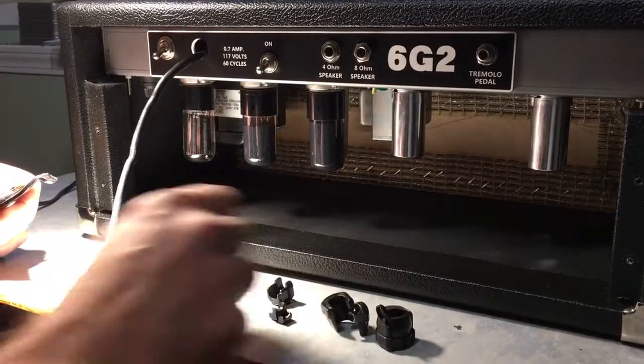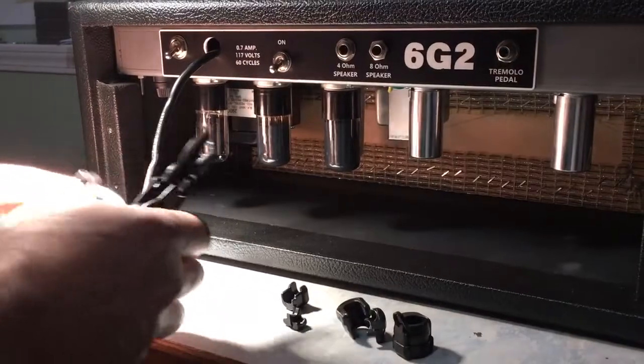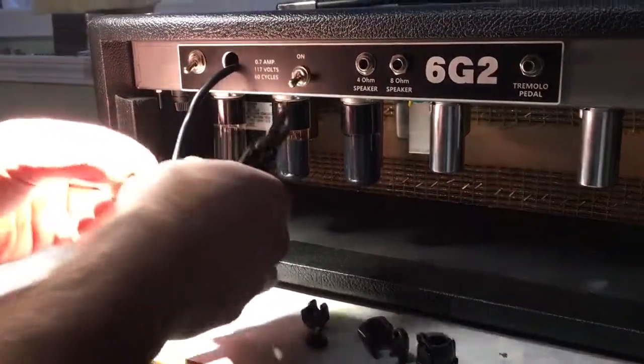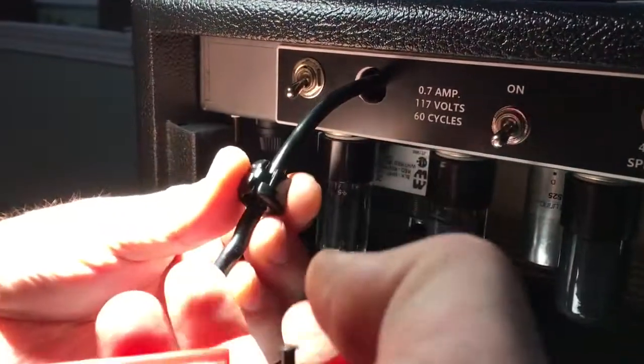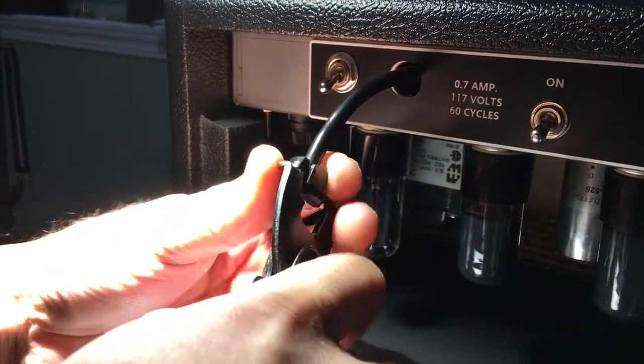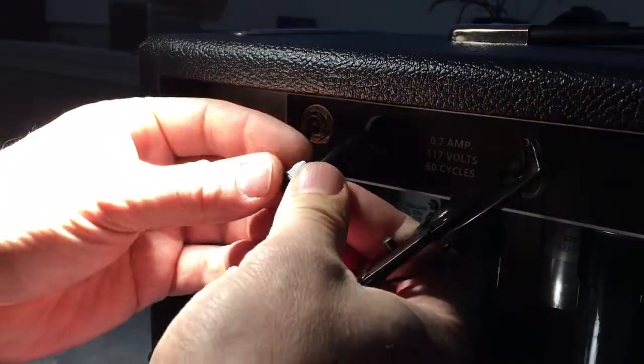He gave me four different sizes here and I just thought I'd show you guys this tool I have. It's a pair of strain relief pliers. If you don't have one of these and you're building amps, I recommend it. You put this over the wire and you use these tools that are made specifically for installing the strain relief.